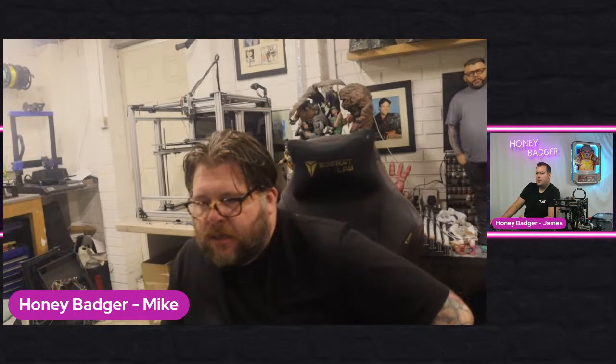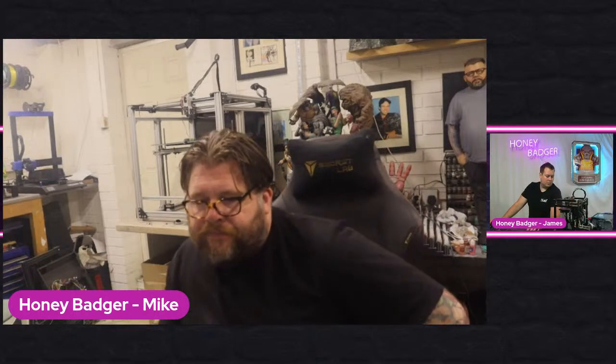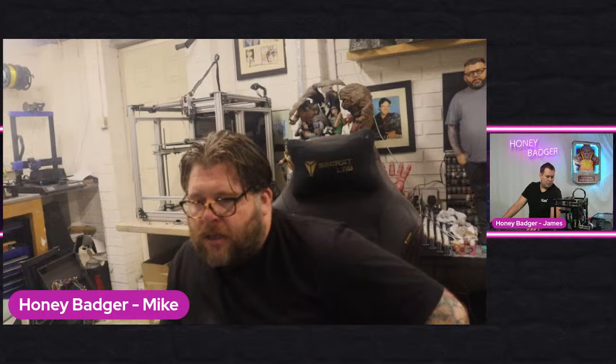So I wonder if we can just comment that out then. There we go. Try that. See if that works. We're going to need to figure out why that... Yeah, there we go. Right, so I've disabled stealth chop, and I rather suspect I need to do that for the other motors as well. Stealth chop threshold gone. Right, saving now.